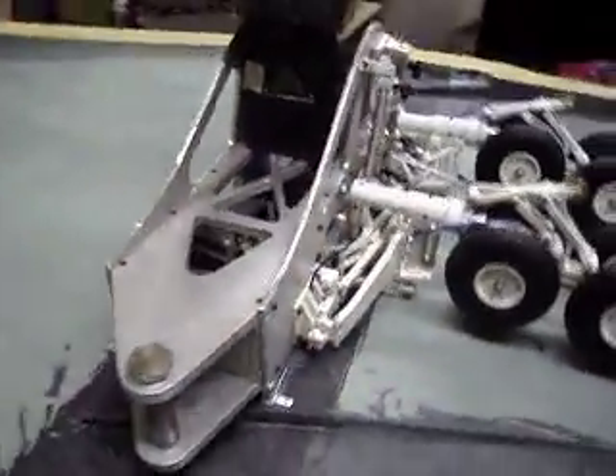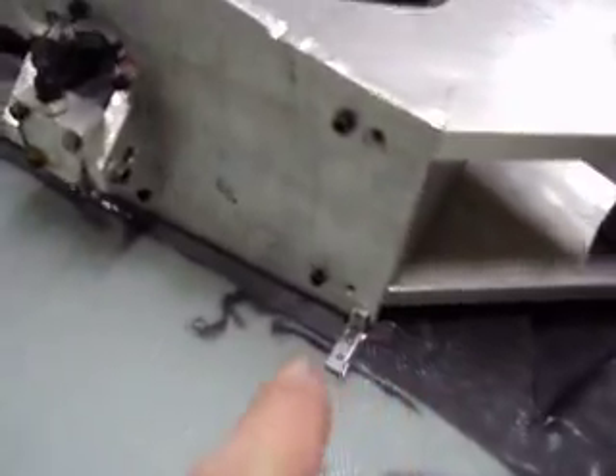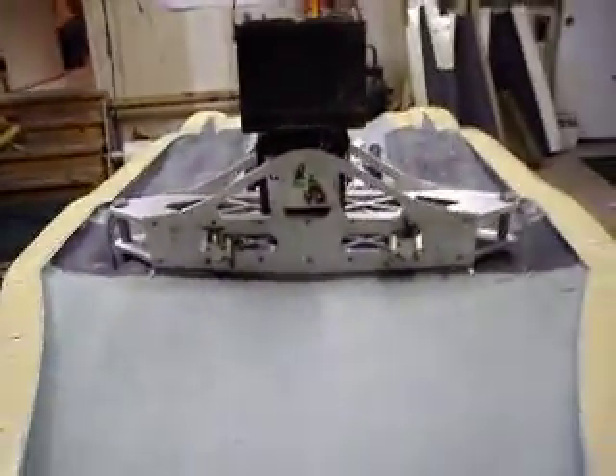I got both my back half pieces done — there's one, there's the other one, there's the back half bottom. Got all of those done out of carbon. The rest of it I used three layers of fiberglass with my same clear resin I've been using all along. Where I'm going to mount my nacelles, I carboned that up with about two layers of carbon going across that way and three layers of fiberglass — that ought to be pretty stout. I put my wood on the inside, got some little L-brackets out here, and JB Welded the whole thing together.